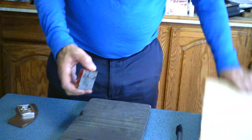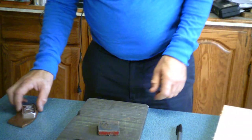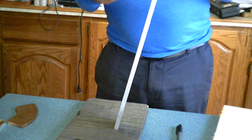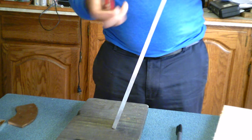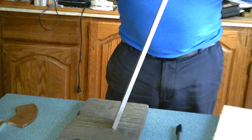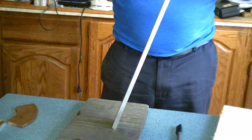If we take a magnet — this is a strong neodymium magnet, one inch by two inch. Now, if I just slide that down this piece of plywood, I'm not so surprised that it just falls. However, if I take a piece of aluminum, what we have is a generator generating into a gigantic short circuit — a chunk of aluminum. And the magnetic forces make a force that's opposite to the force of the magnet. And so the magnet just slowly slides down, unless you get it so steep that it falls away.